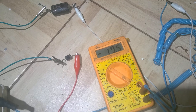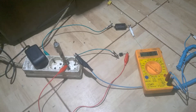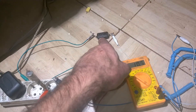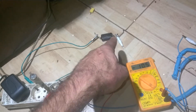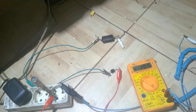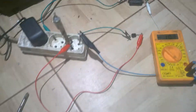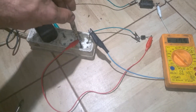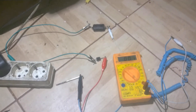As you can see, it's a 1000-volt capacitor but it's leaking about 20 volts and we're only feeding it a hundred-and-something volts — so it's completely gone. Before you handle the capacitor, you need to short it or discharge it. If it's bad you can short one lead to the other; if it's good, put a resistor across it with jumper wires. Be careful not to get shocked, and use a plug or whatever you need to stay safe.